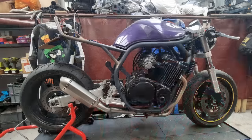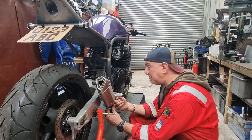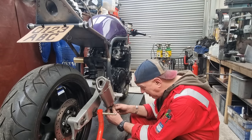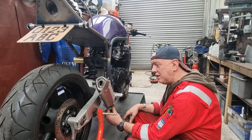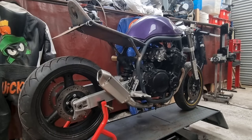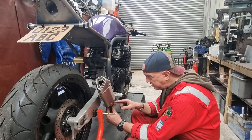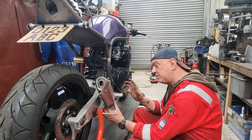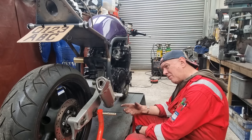So here, there is going to be a little bracket that comes off the link pipe up to the back of the footrest hanger, same as we did on the other one. You're going to see, I don't know, 30mm of it, 25mm, which is bugger all. You're just going to lose it in all this alley anyway. So he's going to be fixed at the front of the collector. He's going to be fixed here to the back of the footrest hanger. And where I've put these slots in the end can, that's just going to get TIG welded over and then dressed back just to be like a seamless tube. There will be a step to it, don't really care. It's not obnoxious, it's not horrible like a big clamp.